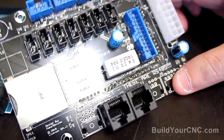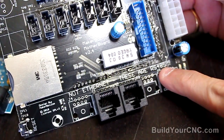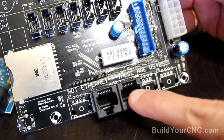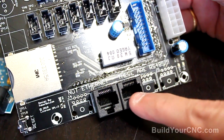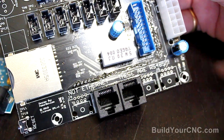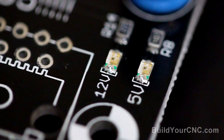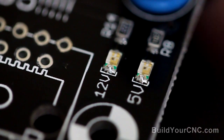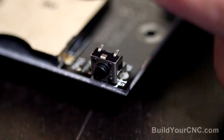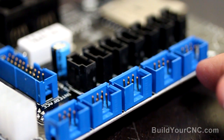As with the previous motherboard, you have two connectors that are RS-485. These are not Ethernet — they have Ethernet type connectors, but really it's just using that connector type, which is very convenient, and using a communication protocol of RS-485. To the right of the RS-485 connectors, there are two LEDs: one for 5 volts and one for 12 volts. A reset button lies right next to the SD card slot.